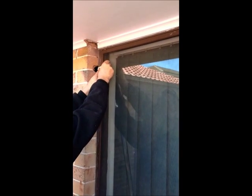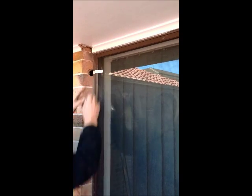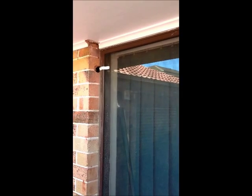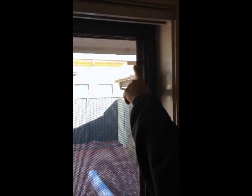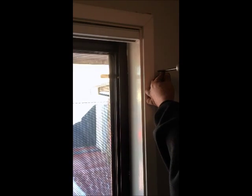So that we can chase the hole inside the house to line up this precise location, simply use some electrical tape and mark against the fly screen or your window so that you can see this location once you're inside the house. So now, once you are inside the home, locate the point by tracing the tape measure to inside the house. Mark it against the gyprock, and by using your 25mm spade bit, drill completely through the gyprock and drill directly straight to the cavity of your house.